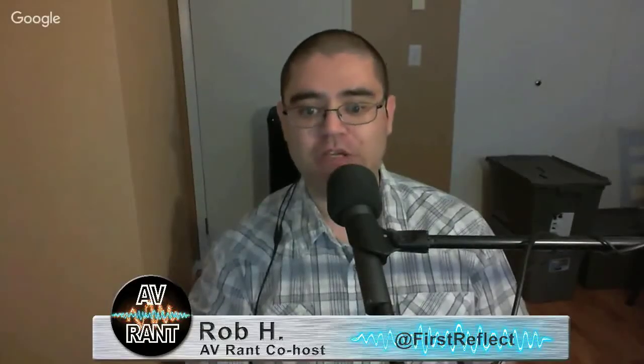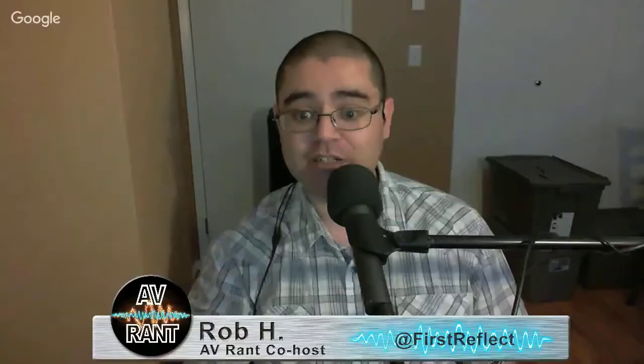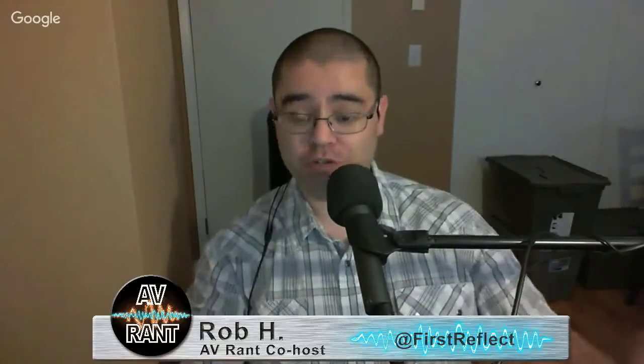It's not your 135. What were the units there? I forget. Well, it's 47 kilo ohms in impedance. The impedance was that, and then the amount of voltage that's coming out of it is equivalent to your standard moving magnet cartridge. Yeah. Now, the end result of that is that if you just took the turntable using this particular Sumiko high output moving coil cartridge, you wouldn't need anything. You could actually connect that directly to the phono input of the Marantz. You could do that, and it would work.